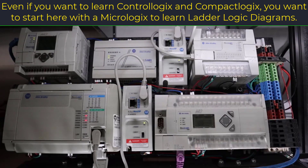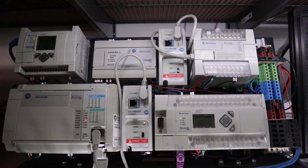If you're after employment, the highest installed base in the United States of controllers that require maintenance is Allen Bradley. I don't use Allen Bradley because I have any dog in the fight — I use it because that's the predominant controller used in industry. For that reason, the software developed for programming and troubleshooting these is more well-developed than any other brand. RSLogix is the easiest software to use on the face of the earth.